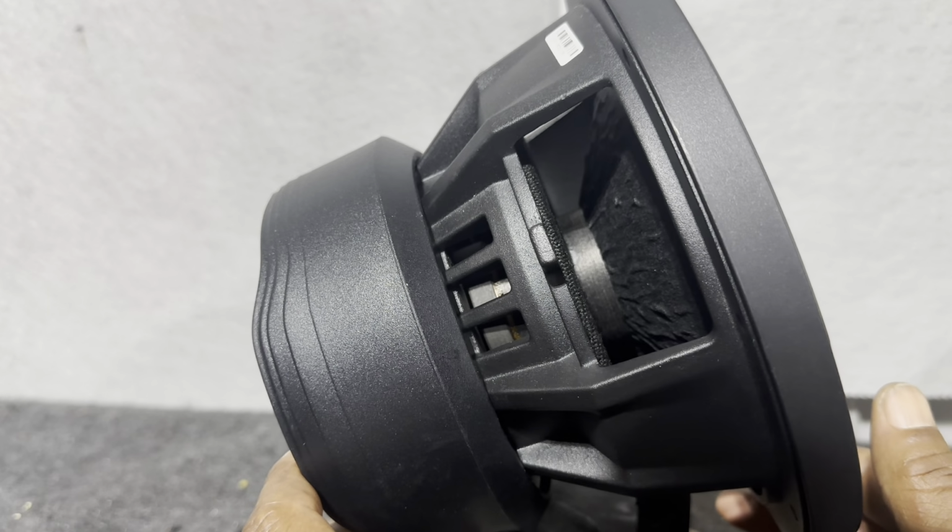Okay, so we talked about the surround, the cone, the trim ring, and the opposed voice coils that are possibly staggered so you can always keep some kind of winding inside the gap, so it'd be linear throughout its entire stroke. We talked about the 13 mm Xmax. We talked about the cone and how it is not attached to the triple joint like most standard woofers. They did something different there. We didn't talk about the dual progressive roll spiders. This has dual progressive roll spiders.